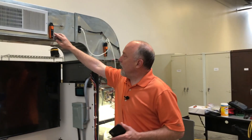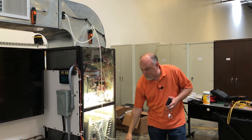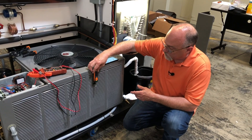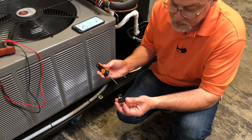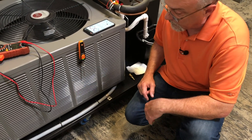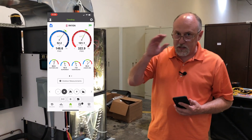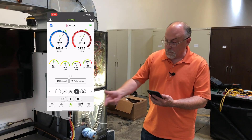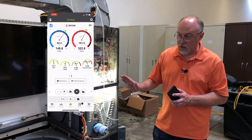I have my 605i measuring supply temperature and humidity, a 510i measuring my total external static pressure, another 605i, and outdoor air temperature measured with a 905i. This one's not a magnetic probe — binder clips are your friend. A lot of times when you have plastic registers you can't use a magnet on, you can just slip the probe through and slide it onto your condensing unit to get outdoor air temperature into MeasureQuick. I've got all my key measurements — outdoor temperatures, pressures, humidities, all my capacity calculations. Using my Redfish meter I pulled in some electrical and I've got my SEER and EER.